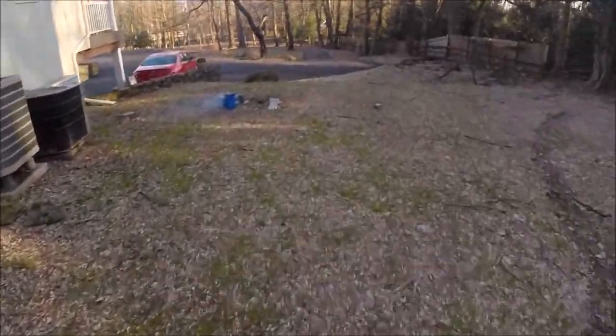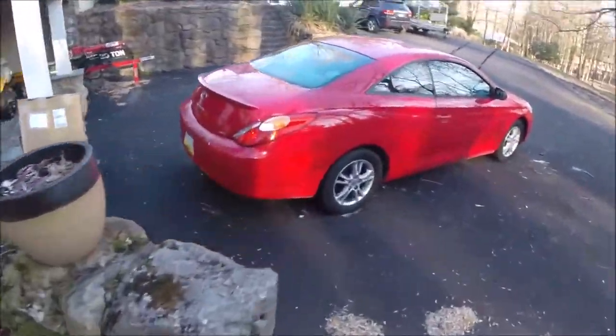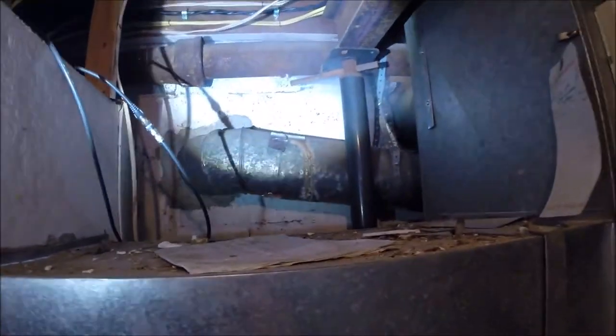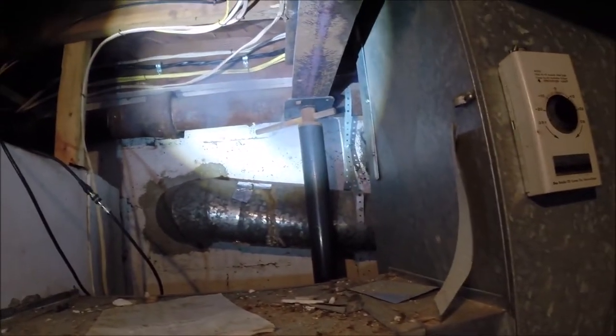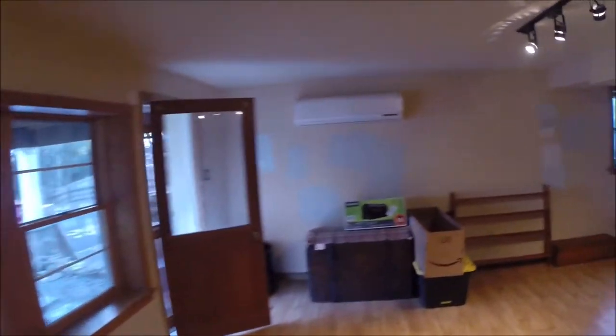The scent was down here, so we're looking for any trace of smoke. And sure enough, here we have it — smoke is literally pouring out of that pipe right there. You can see the corrosion. That is definitely the problem we had not found earlier, and clearly that is where the odor is coming from. So now we know what to fix. I'll also mention that this smoke is non-toxic, so all we have to do is open up the windows for a bit, air it out, and we're all set.